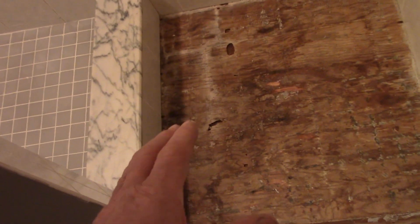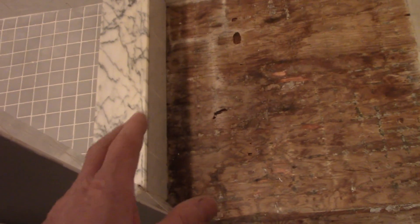I've got a lot of things going on downstairs and I plan on doing some epoxy counters, so this is going to be a good practice piece. This is what the tile was originally mortared to — just a regular subfloor. I got this little piece of underlayment to take up the gap in the tile. It turned out to be an exact measurement, so I just fit it in. Then I traced the cement board piece the same way, and the PVC piece went over that.